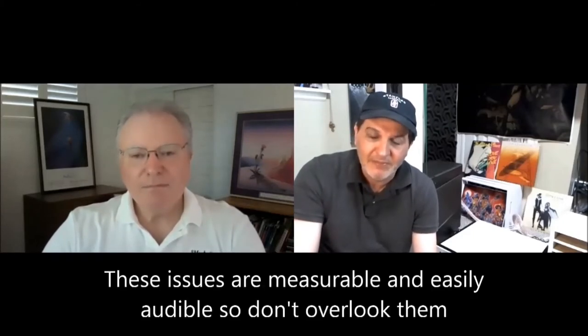Well, I think for some of the viewers that may be newer to being an audiophile or less technically inclined, it's important to highlight what Steve was saying about passive preamps. There's a lot to like about them, but personally I had the TLC1 at one time, which did have the buffer stage, and I've seen people buy passive preamps and have less than desirable results because, as he said, high capacitance cables, depending on what you're using, or the length of the run to your amp, and then a poor input impedance for the amp can cause a lot of problems. So it's important to be cognizant of those issues and understand them. And again, working with Steve over the years, this is what I've learned: if you're thinking of a passive preamp, make sure you consider all those variables. Yeah, it's useful to understand the pros and cons.